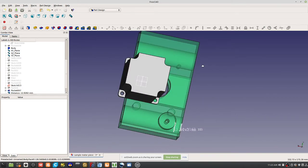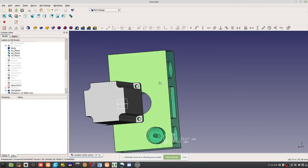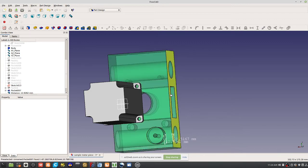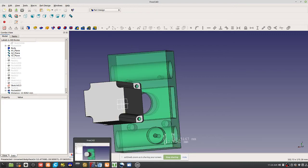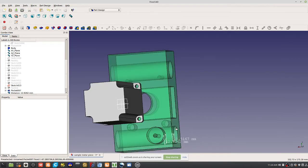Let's use M6. Is M6 sufficient to hold 100 pounds? M6 is about a quarter inch, so this is a back-of-the-envelope calculation. A quarter inch is approximately 1/16 of 1 square inch. And how much strength do you have on 1 square inch of steel? That's a real question for everybody: how many pounds does a 1-inch rod hold in compression, shear, tension?